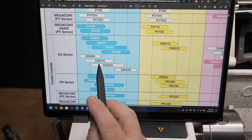That's basically what it's designed to do. So that's all of the calculations we needed to know for the feeds and speeds. What I've found out now is that, for the steel, about 1250, half millimeter cuts to a millimeter, keep the infeed speed what it is, never change it, and I'm good. That's the ballpark. I know I'm doing it right. If I wanted to switch to the high-speed steel, it's much slower. They say take the speed down to half even. And so I will just bear in mind that I might drop it to 600 if I'm doing steel.